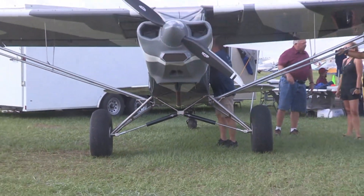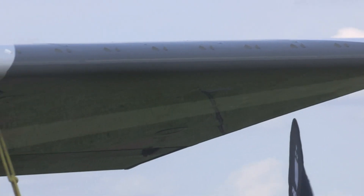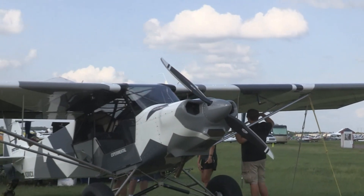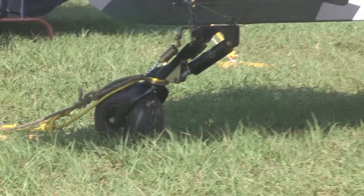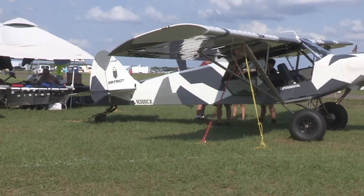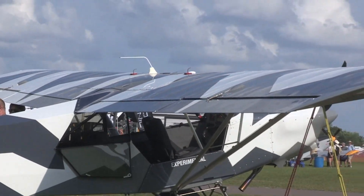The wing is fabric covered. Some other parts are not. All the parts come CNC-routered. The cowling is already made but they still have to fit it — it's a carbon fiber cowling, custom made. Everything from pretty much the front right here by the door back is all fabric. But we really slick it out and fill the weave so it looks like metal when it's all finished.